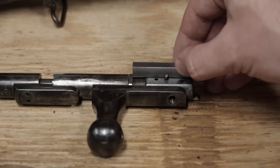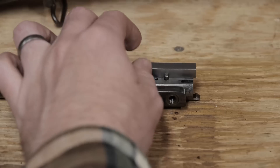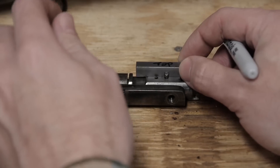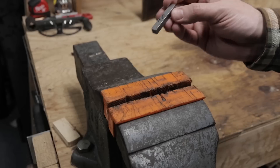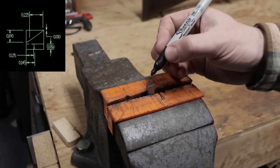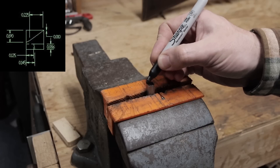I'm going to refer to the side that fits against the bolt body as the bottom. Looking at the drawing, the sides don't have any features — only the top, bottom, and front faces. The front face is a bit ambiguous, but looking at reference pictures of ejectors online, it looks like the angled piece is on the top left, and the area to the bottom right is milled away.